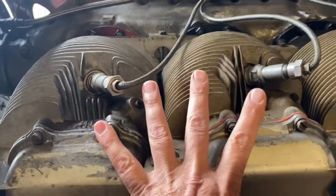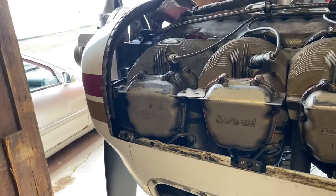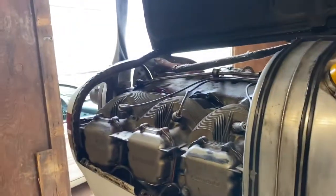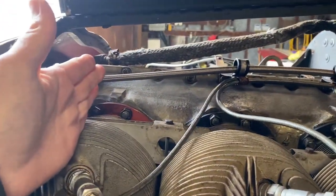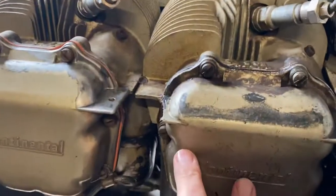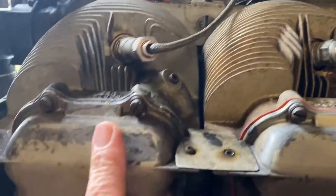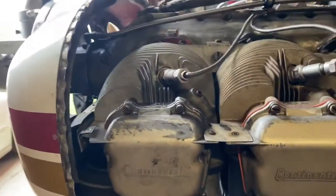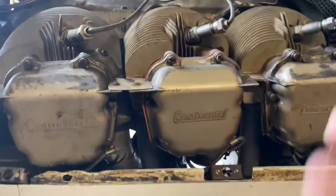The cylinders, pistons, and rings got treated at cryo heat and will probably be shipped out today or tomorrow, arriving sometime next week — all six cylinders. Then I plan to send the oil cooler, the baffling, and most likely the connecting rods and rocker arms out for treatment as well, and put new bushings in them. The new bushings will also get cryo heat treated.